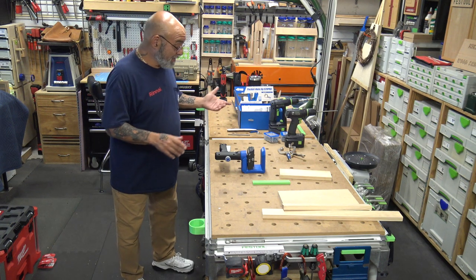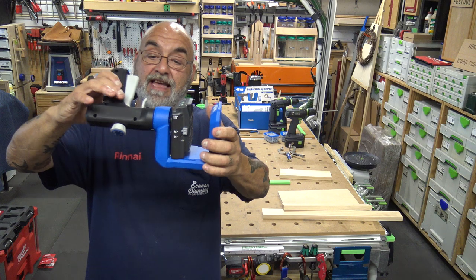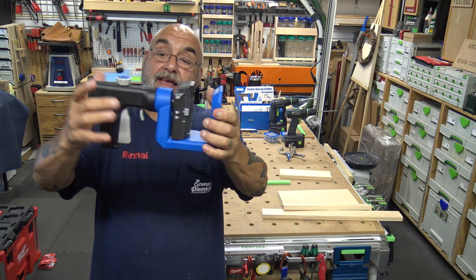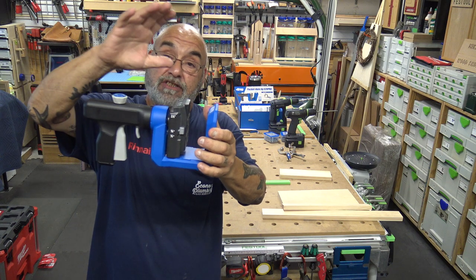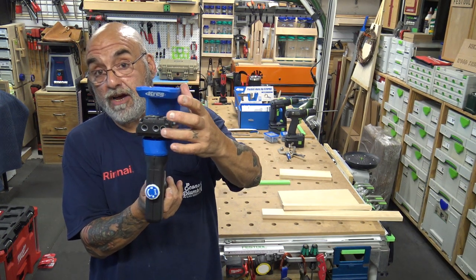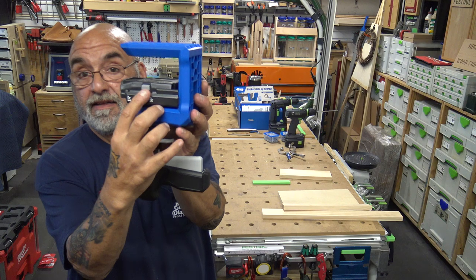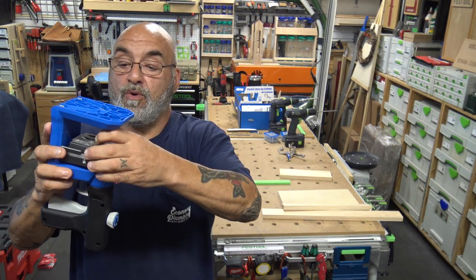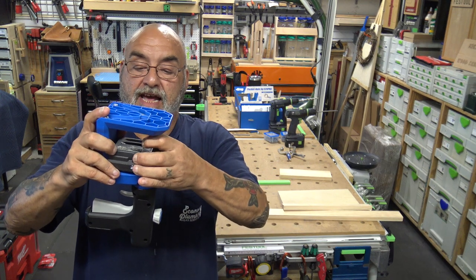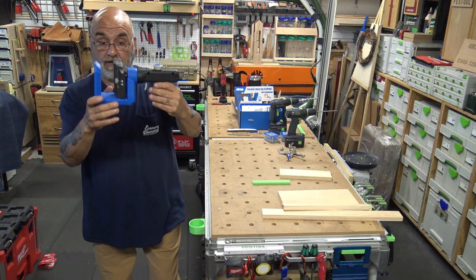It's $99 and basically it comes with this tool which actually revolves eight different ways — the handle. Then you pump it to lock it, and you release the lever here to open it. There's also a lock that will keep it from moving if you accidentally hit it while you're working. It has the three hole positions just like all the other jigs, and on the side it's got two gray adjusters. You squeeze and move — it's a little stiff right now — so here's inch and a half for a two by four, then down to three quarter, then half inch.